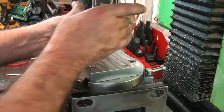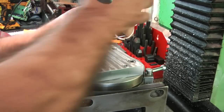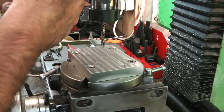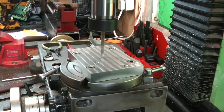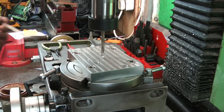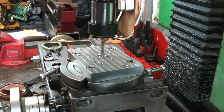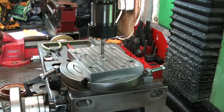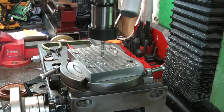Someone commented last week about me using the ER32 collet chuck in here. It's fairly versatile — I can swap between tooling quickly, certainly quicker than swapping between collets straight in the head. Now I have got myself positioned over the centre of the rotary table, so I can drill through right through this block without any worries of going into my table. I'm going to put a quarter reamed hole in here. I'll bring you back when we've got a quarter reamed hole through here. I'm over the centre of the table anyway.